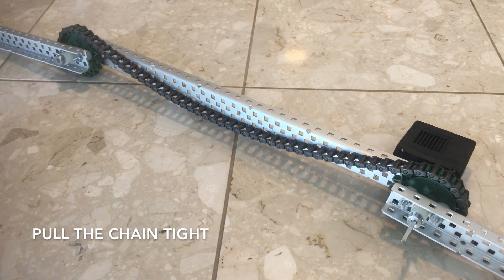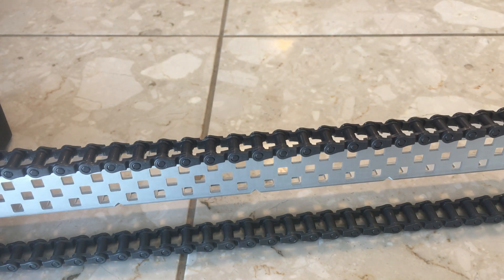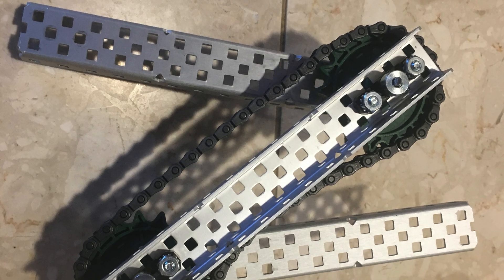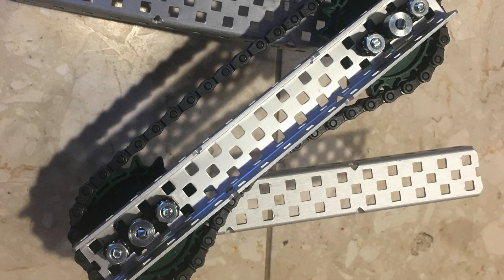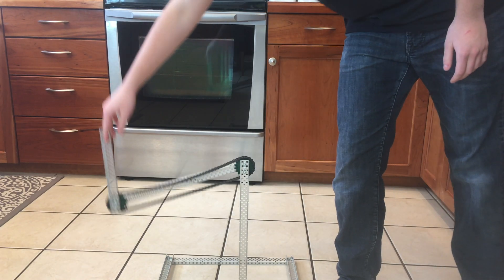The chain can be extremely tricky to snap together, especially because you must keep the ends parallel as you do so. Even after snapping, the ends were not perfectly parallel due to the spacing between the sprockets resulting in slack in the chain. You could fix this by using chain tensioners, but I wanted to keep this video simple and concise and just show the basics.